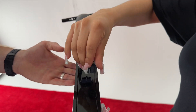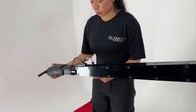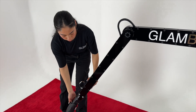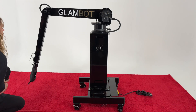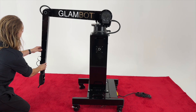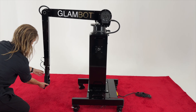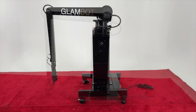Next, plug in the cable on the wrist into the panel on the top side of the arm. If holding the arm, gently let the arm fall to hang vertically to a 90 degree angle. Double check that the arm is at 90 degrees. If your camera, GoPro or phone is already attached to the wrist, ensure it is gently tucked back toward the base to avoid damage.